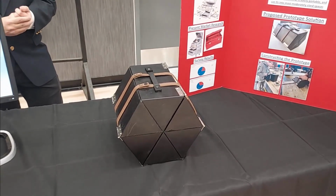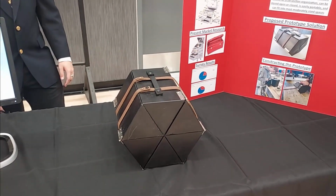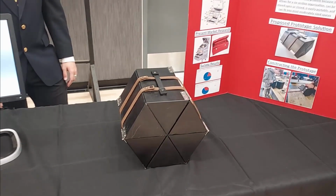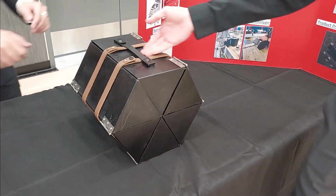And then we bent the sheet metal with a box brake. Once they were bent, we welded the gaps together to make them nice and strong. And then you drilled holes for the hinges, correct? Yep, the hinges and the struts, and then we can hang it up as well.